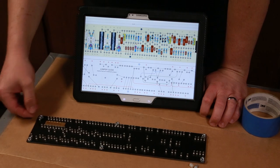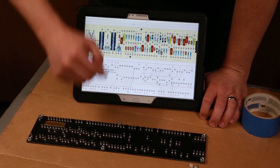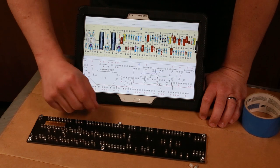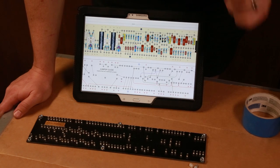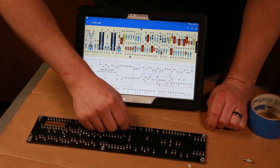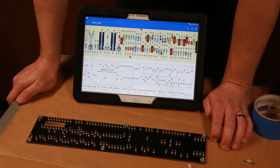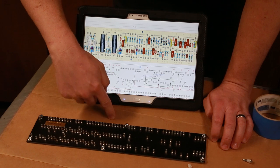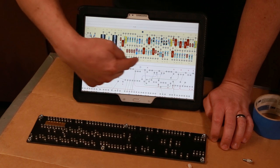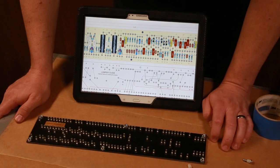I've got to figure out where to drill the holes for these mounting points. The corner ones are pretty much okay with plenty of room. The trickier part is one that's a little too far to one side. I need to be careful because these are metal screws, and if you accidentally ground two turrets together that's not good. I need to find the best spot, keeping the nut as far from the bolts as possible to avoid any unintended grounding.